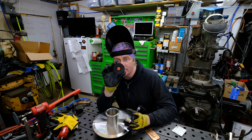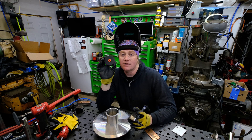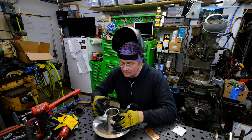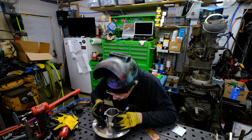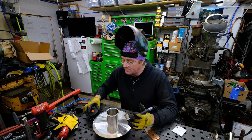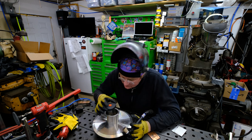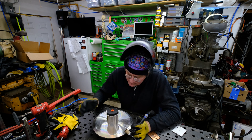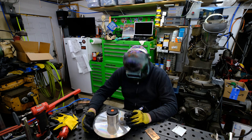I've got a purge plug on top — this one has a little vent hole in it. That 15 to 20 CFH works really good with these. I'm just going to eyeball this to get my alignment and then put the purge plug in there — I'll probably just set it on top when I'm ready to weld, being very careful not to move it. I'm just going to go ahead and get a tack on this guy.